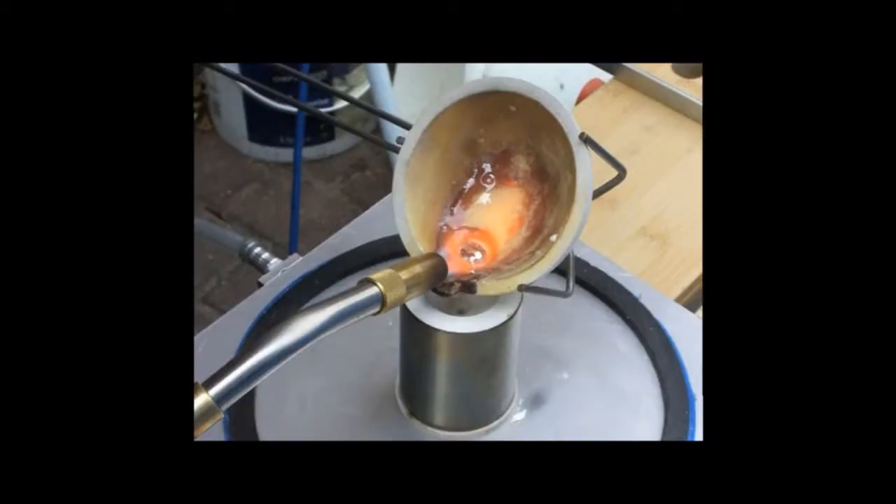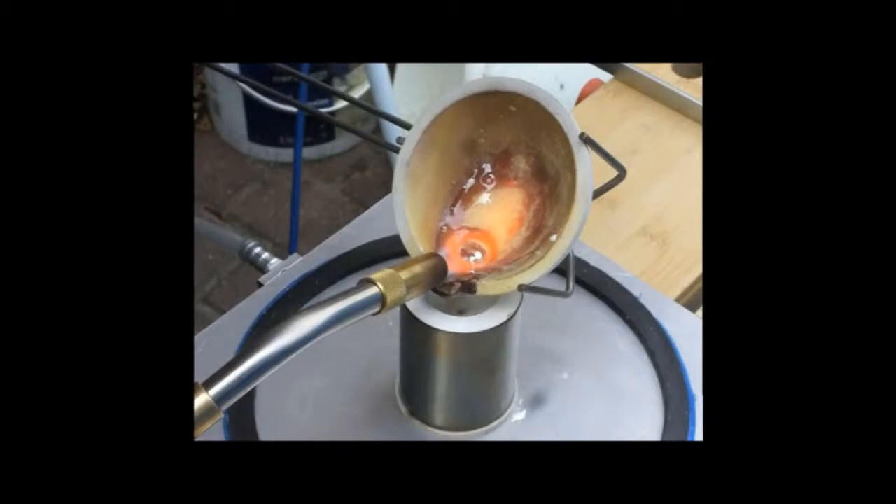The wax was still in place at first, but obviously in the kiln it burned away and left a hole in the middle — this is called lost wax casting because the wax is lost. It also means you can only make one copy. It took me something like 15 attempts to get this process to work, so it's very frustrating. My recommendation: make 15 things that look rubbish until you've got the process right, then make your final object. I realized on attempt three I wasn't making progress, so I started making lots of little wax coins until I had the process down.